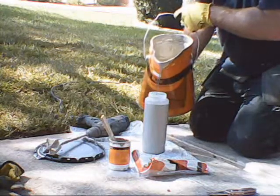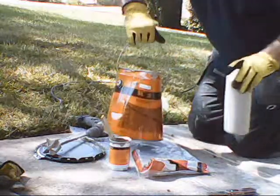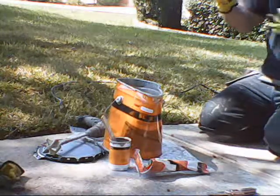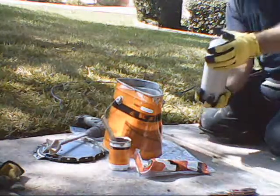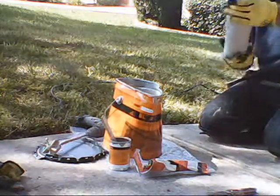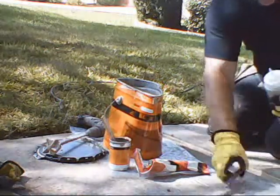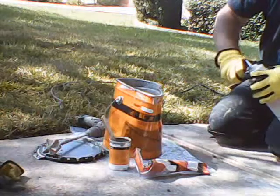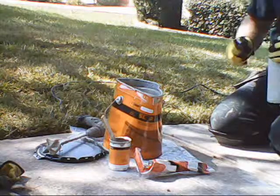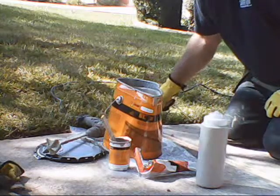When you get to the top, slow down, dribble, and pop that last piece against the can. Set it back on the plastic — plastic is key. Put that lid on nice and straight; if you get it crooked you're going to have a big mess. Stay as clean as you can as long as you can. Now cut the tip all the way down to the last line — there are two lines on here and I cut it to the very last line. Now we're ready to start putting it in our joint.